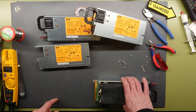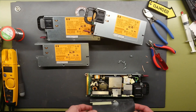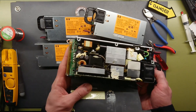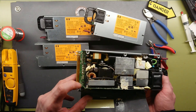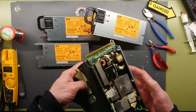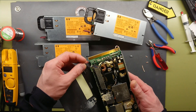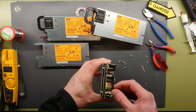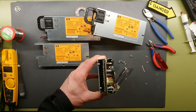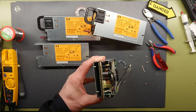To do this, I have removed the four screws for the outer shield. There's a small isolation layer of plastic. Then inside, we have two screws and a ground wire. These have to be removed, and either replaced with nylon screws, or we simply have to saw off these two standoffs and replace them with something else. I will try to pry these two off with a plier and see what I can make instead.